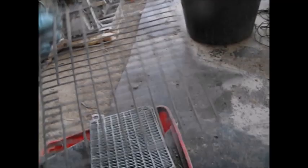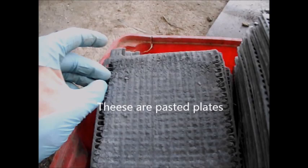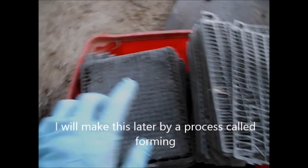This is what makes batteries work. You have lead plates. Lead plates on their own wouldn't be very effective because they don't have very much surface area. So what they do is make lead plates with lead powder - essentially a spongy lead, like lead powder with fiberglass thoroughly mixed in. That gives it an incredibly high surface area. This is the negative plate from inside a car battery. The positive plates are usually surrounded by rubber or fiberglass to keep them separated.